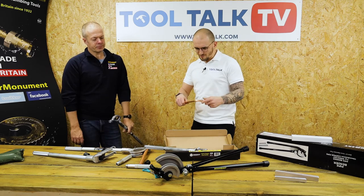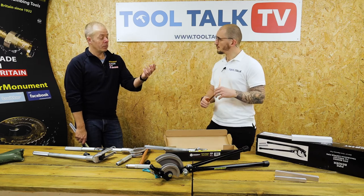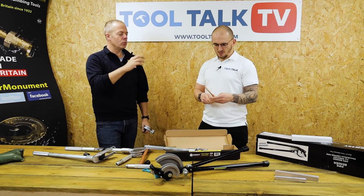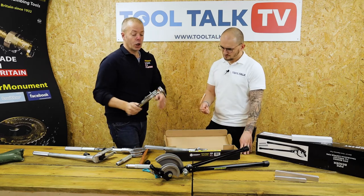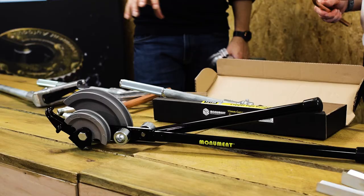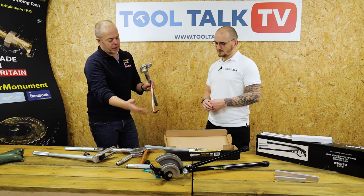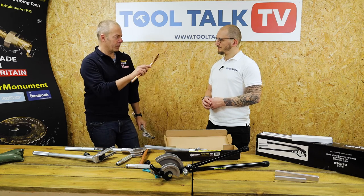What's a nice bend mean for a plumbing or heat engineer? What would make someone look at the bend and say no good? One of the important things is that it doesn't ripple. Rippling is when the pipe tends to look like a wave — a number of waves on the inside of the pipe, like it's crimped slightly. It looks awful and it will interrupt the water flow. We've tried to ensure that the radius on this bender is as close to the radius on the combi. Does it create a tighter bend than a combi bender? The answer is no — it's a very similar bend. No rippling, a nice clean bend.